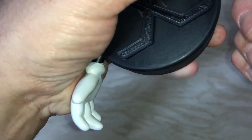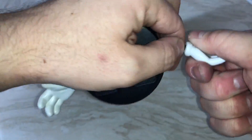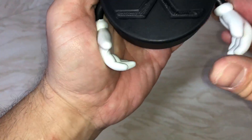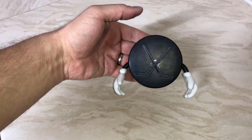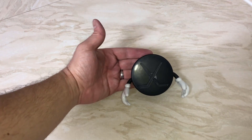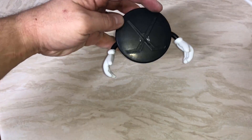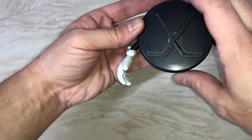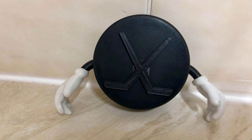As you progress to final assembly, I would suggest gluing everything with Tiger Seal. There's a product called U-POL Tiger Seal — it's a polyurethane adhesive, it's ridiculous how well it holds everything together. It stops the hands sliding backwards and forwards and stops them dropping off. It is black in colour — body shops use it for sticking bits of bodywork on cars. It's very very strong, but it is very messy so make sure you wear gloves.